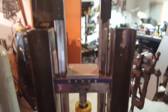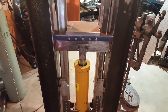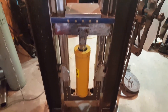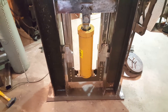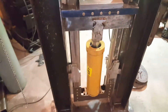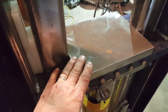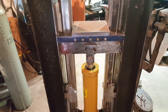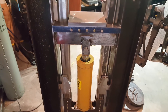Part of what I wanted was a low-profile press. At about 29 tons, it's fairly low profile. I did give up about two and a half to three inches of stroke capacity — it's a 12-inch cylinder, five-inch diameter. But by making the upper die holder adjustable to slide up and down, I'll be able to fit just about anything under the dies. It's a trade-off, but having that adjustable upper die holder works out really well.